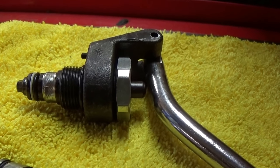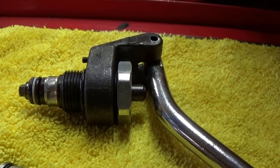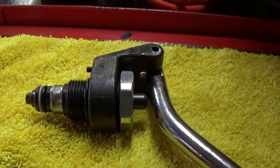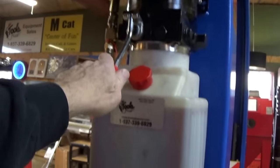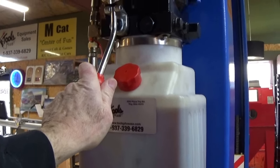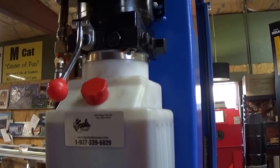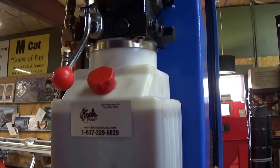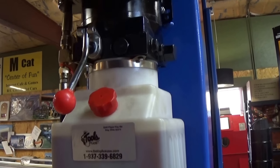Or if there's a malfunction in the piston and seat — maybe from the factory they didn't make it just right — that will be a problem right from day one. If you've used the lift for a while and it's having that problem, you probably just need to clean it. What they suggest is to push the lever in and push the go button at the same time and let that run for 10 or 15 seconds. Generally speaking, that will clean the debris out from between that little piston, and then it will function correctly.